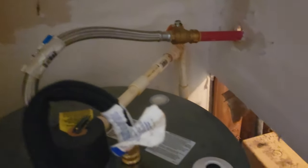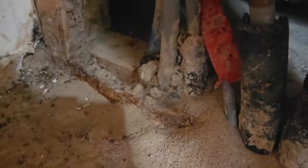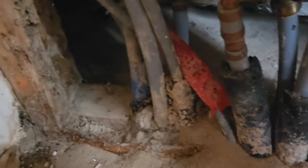It does not stop, so that means we have a cold water side leak. The next thing you're going to do is trace your lines going down into the ground. It comes up here — this is all manifold — and looks like there have been repairs here before. What we're looking for is possibly the main line that comes up, so what we're going to have to do is cut the line and cap it and see if that stops the leak.